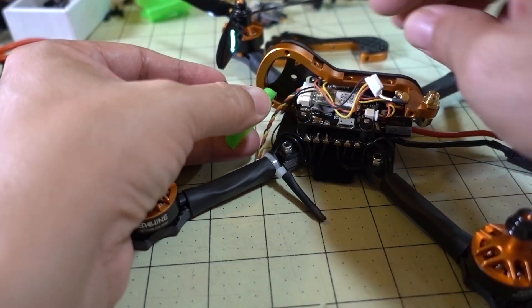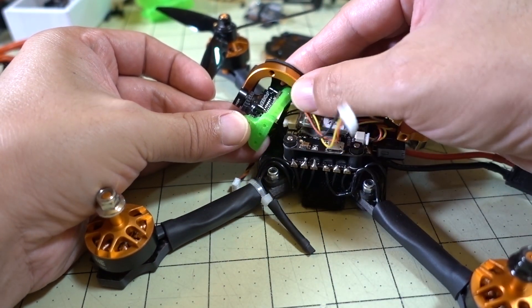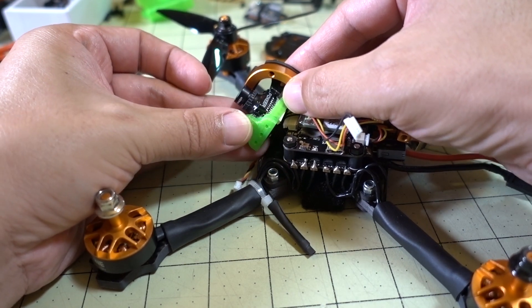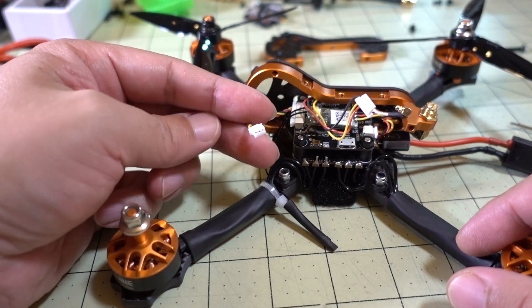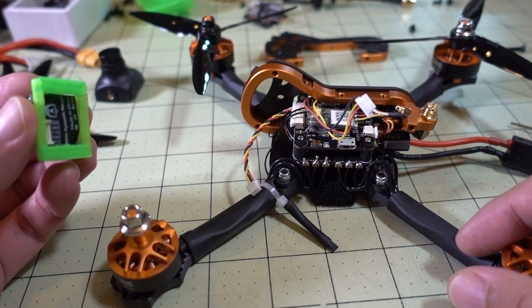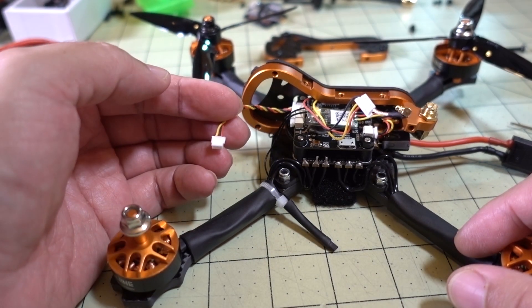Just to give you an idea what it looks like — it'll look kind of like this. You'll see the camera is going to be a lot better protected, it shouldn't stick out too much, and you'll have a little more adjustment angle. One of the things that's going to be an issue is the connector here is going to be too big for this camera — it's a wider pitch meant for the other camera — so you're going to have to do a little more soldering and cut this connector off.